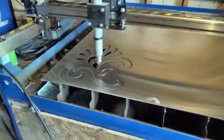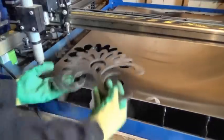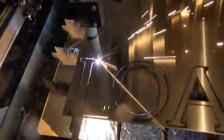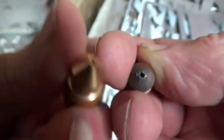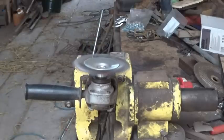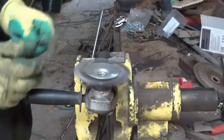And it cut out most parts perfectly, which was a relief considering the price of the material. I did need to replace the tips 3 times though, through the job. Despite having 3 types of dryer in the airline, the air is so moist here, I get through a lot of these things. One of the downsides of living where we do, perhaps.